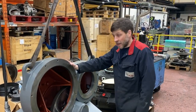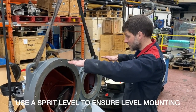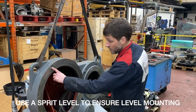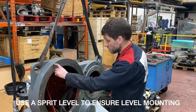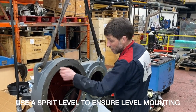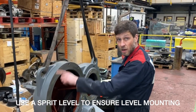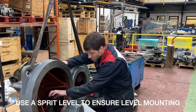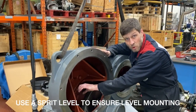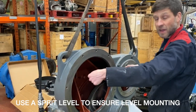One other important thing to remember when fitting the air ends is that they are finished in a really square orientation. You can have a situation where the air end is slightly kicked over from the clearance around the bolt holes. So when fitting the air end, leave the bolts loose - you can see by rocking the air end from left to right, get it central, and then lock it up. The pinion gear sits on the bull gear, so as the air end is rotated the pinion gear can move away or move in towards the bull gear. It's crucial that we get it located central.